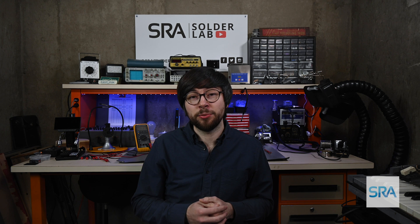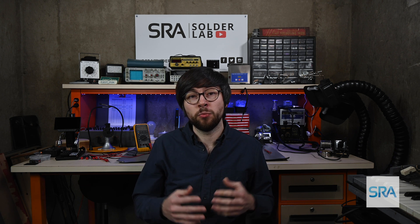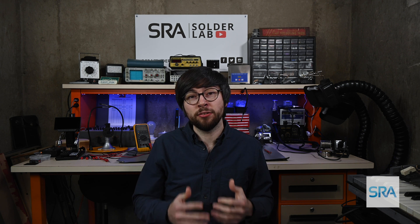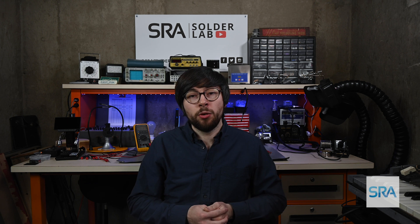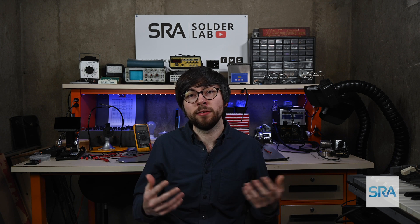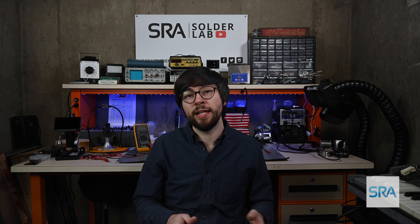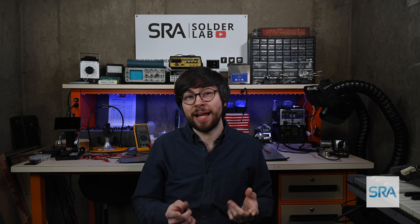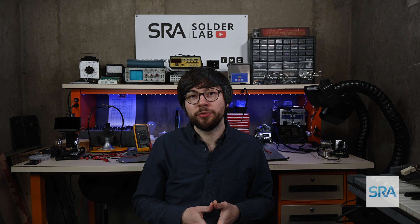To stay safe, the number one safety precaution to take when soldering is to do so in a well-ventilated space, such as next to an open window where air can circulate. We recommend incorporating a standalone fume extractor or one integrated into your iron to redirect the fumes. Whether it be burning flux, burning plastic, or other chemicals, the fan will pull the fumes away into its carbon filter and get them out of your face. You can also cover all your bases by wearing gloves and eye protection. I hope you found this information helpful, and for more soldering tips and content like this, be sure to comment, subscribe, and hit the bell icon to be notified when new videos are posted — it really helps us grow and make more content like this. Thank you.